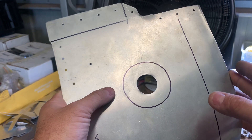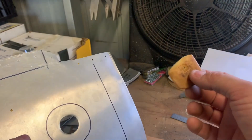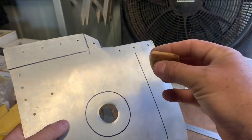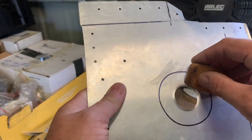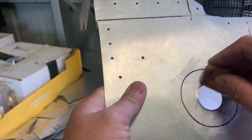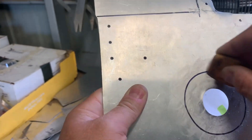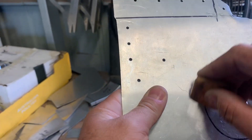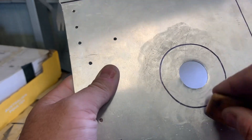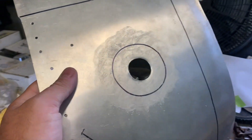Engine baffles are absolutely secondary structure — it doesn't really matter if it cracks, you're not going to crash and burn. So I cheat. The simplest way I go about it is I get Sunlight soap — basically the cheapest soap you can come across, not the exotic stuff. I just rub it all over where I'm going to heat treat, because then when I use my burner it'll go black, and you'll know you've got the temperature up enough. Then I'll quench it in water. Other guys use oxy-acetylene — a black sooty flame to coat the whole piece in soot, then change the flame and burn the black off. Same thing — it anneals the material that way.